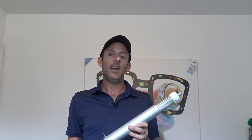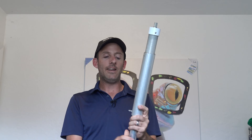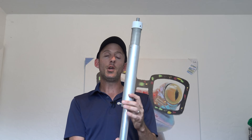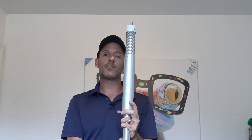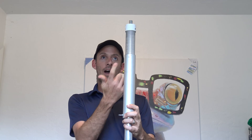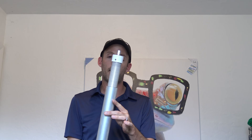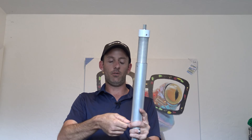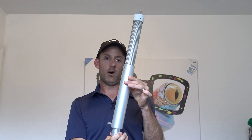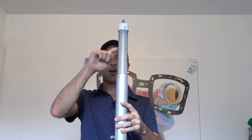What you're really doing is adding length to make this electrically longer. Now this is a compromised antenna — a full-length quarter-wave antenna on 40 meters would be 32 feet. You move this up and down to find where it's resonant on 40, because your antenna with the amount of windings plus the whip on top equals electrically 32 or 34 feet. So 80 meters, being the longest, would be pretty much all the way down — most windings in use plus the whip on top.